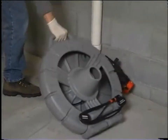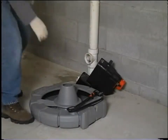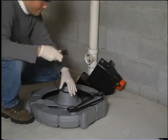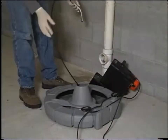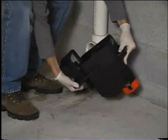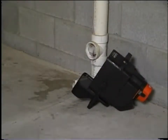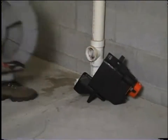After reading all the safety information in the operator's manual, place the drum so the push cable is easy to manage as you push the camera through the line. Two to three feet — about one meter — from the access point is usually the optimal location. Set the monitor in an area where it is unlikely to fall and where it can be viewed while pushing the camera; a good location is right next to the clean-out or entry point.